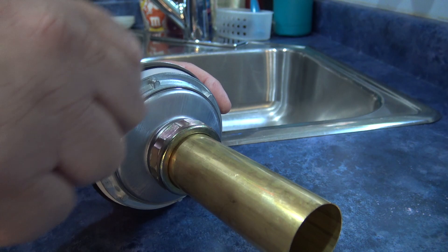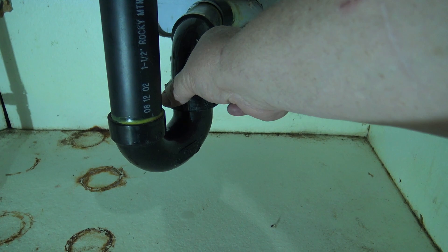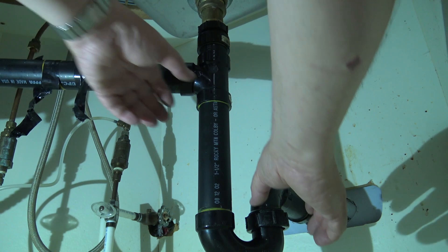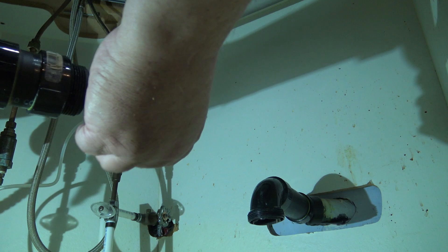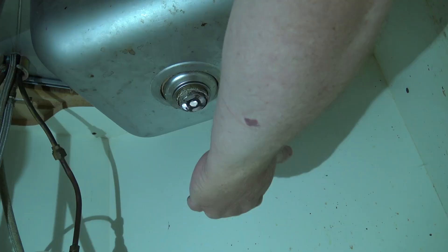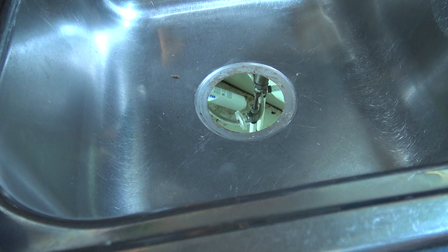This is held onto the sink by a large nut which we can spin off. Before doing that, I'll go below and remove the pipe. I've already loosened off the trap and drained it. This is where it's broken — it's leaking right here, actually broken completely. We'll remove the old piece, then remove the plastic washer and nut, and remove the old strainer to break the seal. Then we'll remove the old gasket material and clean up the inside of the sink before putting the new one in place.